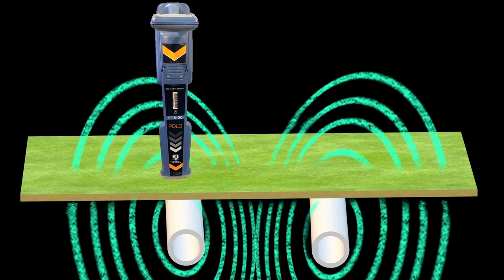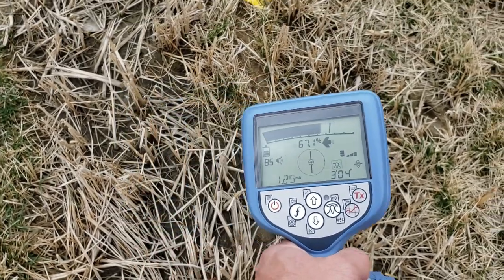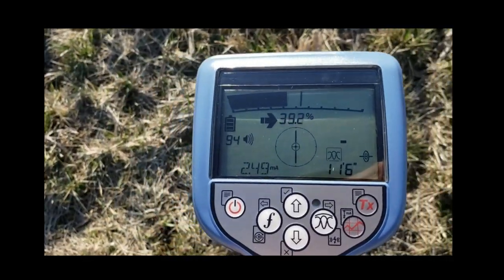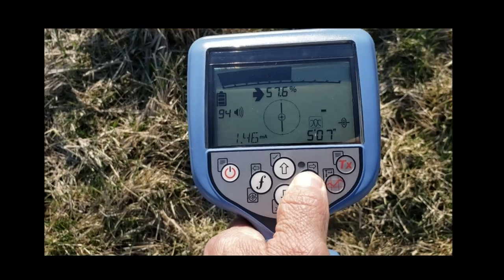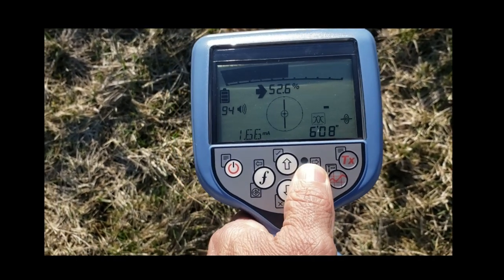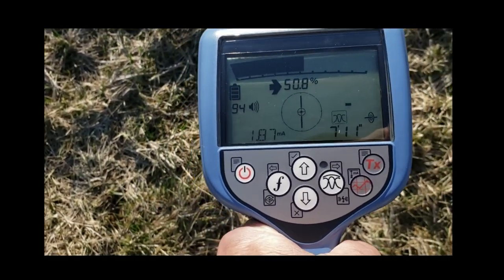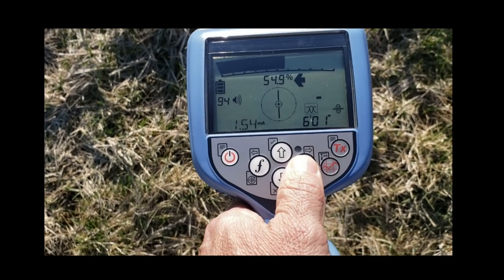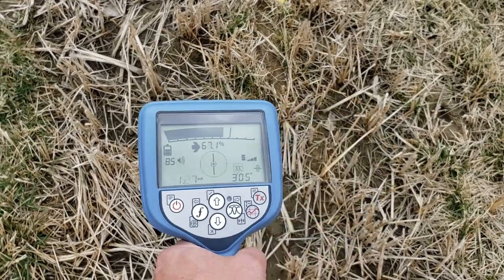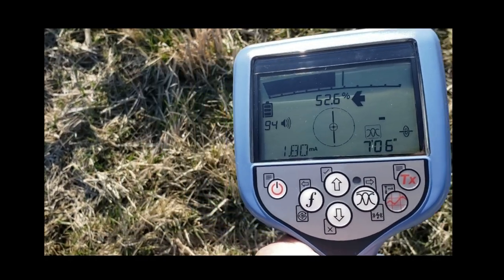When using the combined peak and null mode, you get all the information at once. Within peak and null, there are two types of null mode responses. The old-school single-antenna null mode is activated by holding the antenna button with a long press — you'll see 'null' appear in the bottom left corner. Hold it another two seconds and 'guide' appears, which activates guidance arrows. The null style uses a single vertical antenna, while the guide style uses more elongated arrows telling you how far you are from the line.